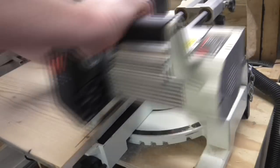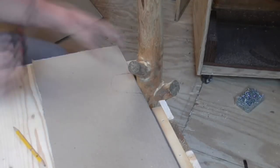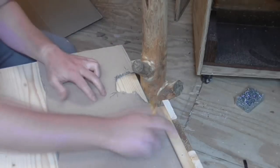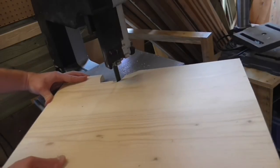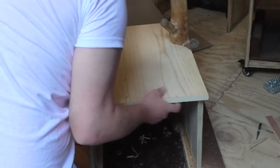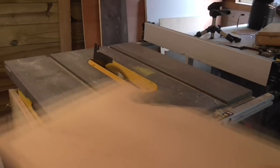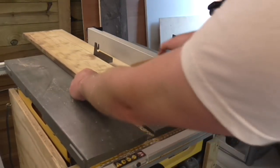I then trimmed the edges on the miter saw. To cut the panel so it would fit around the log, I made a cardboard template by snipping away with scissors until I found the right contour. Then I transferred this shape onto the wood panel and cut it out on the bandsaw. That was a pretty good fit, however at this point I realised I'd made a miscalculation and the panel was not wide enough to cover the whole enclosure. So I squared off the outside edge on the table saw and ripped another piece down that I could glue and clamp on to make the panel wide enough.